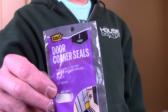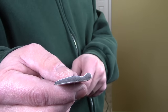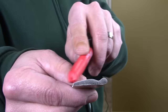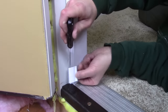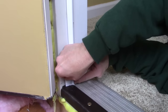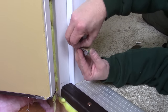If you made it this far in the video you're saying, wait a minute, where's that square thing you showed? Door corner seals are the final step in your weather stripping job. This is what's going to make all the difference in the world in how much of a draft you stop — you definitely need to put these in. You'll notice when you look at the side of these you have a thin edge that gets a little fatter and then a thick edge. The thin edge is going to go towards the door and this fat part is going to tuck behind your weather stripping. We're just going to take these little squares and stick them behind our weather stripping only at the bottom. Once you trim it so it fits your threshold pretty well, you're going to want to take the backing off the sticker on the back. This stuff is really really sticky so you only get one shot at this.